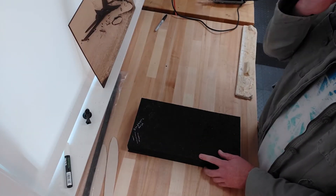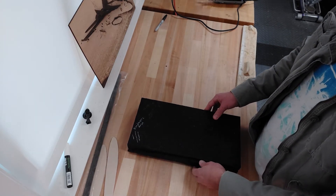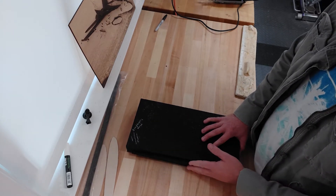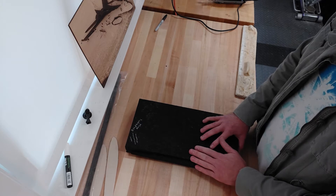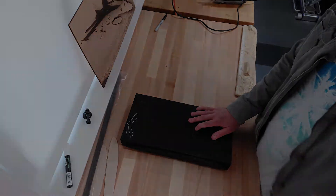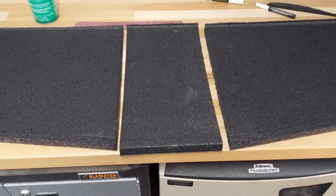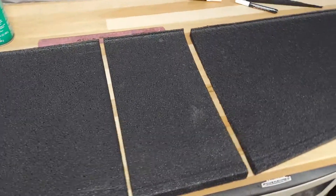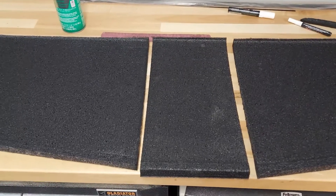The reason for doing just one side at a time was so that I can push this airfoil through now so that it sits proud on the other side, and attach the rib to this side without it sticking to the bed. I'm going to repeat that process for the other wing and this side of the core, and then we'll move on to the next step. After you get all the plywood ribs put on, next we're going to bond the lower beds only together with 3M90, and this is going to help you when placing the removable spar to make sure the wing is perfectly straight.